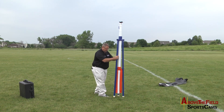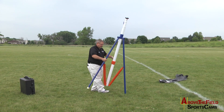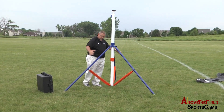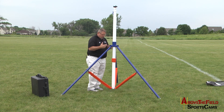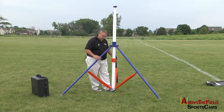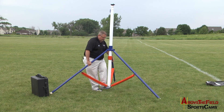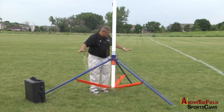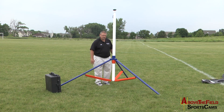I usually post this first leg here and simply spread it out. When you get about here, even though it looks like it's spread out, it's not spread out far enough — you want more stability. Our design is to load the three legs. So with one foot, lift that up and allow your legs to slowly fall down. Now you have about a ten and a half foot diameter, which is very stable for your camera systems.